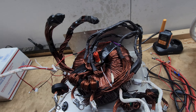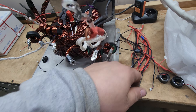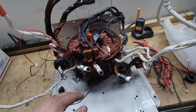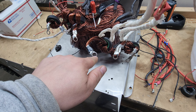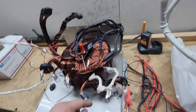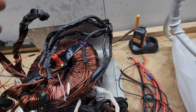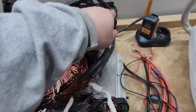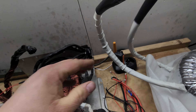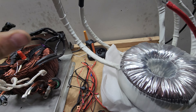There are a whole lot more individual primaries on the old one — fourteen in total. One of the main reasons was because the factory told us they could only use a certain size terminal and didn't have the tools for bigger ones, so they ended up using smaller ones with fewer strands per terminal. That's why you've got this entire mess. Essentially one primary comes out, splits into three. But with the new transformer, those six wires here represent the same thing. Just these two represent six of this chunk, so imagine how much cleaner and neater this is going to be inside the actual inverter.